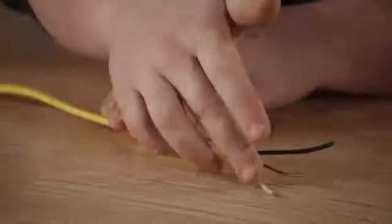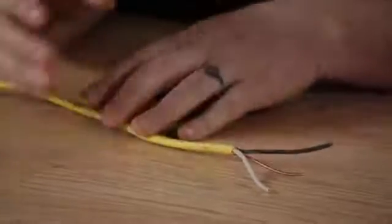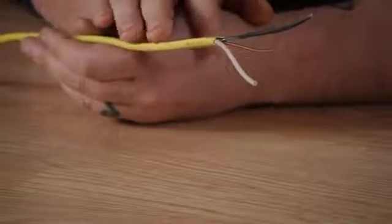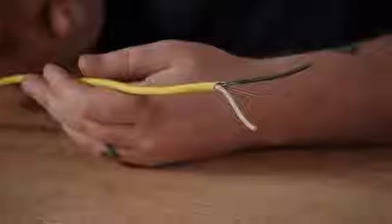What I do is mark it with a piece of electrical tape and mark 'hot' on there, so the next person working with this can see that it's a hot and know that it's not just a common — common is usually sent to ground. A 12-2 wire will work just fine because an electric baseboard doesn't have a common or a neutral.